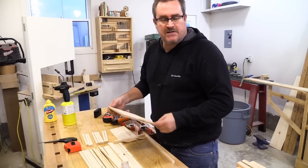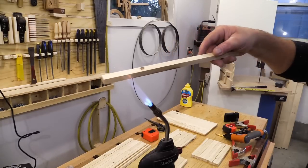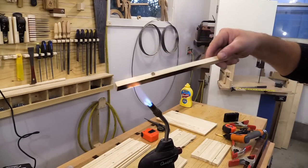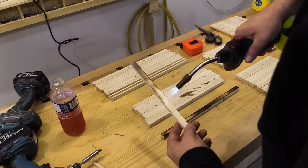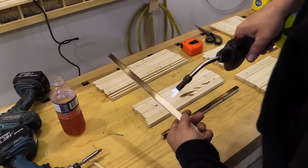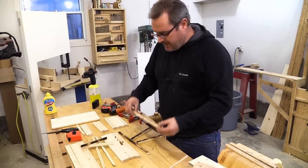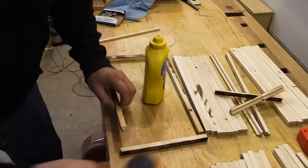Now that I've got the bottom finished, I can start assembly — and that's pretty straightforward. But before I start assembling it, I have to pre-scorch the wood with this torch to give it an appropriate look. I know this is tearing a page right out of the 1970s souvenir-making playbook, but it does give me the look I'm going for. Now that I have the first few pieces scorched, I can start putting it together, beginning with the row on the bottom — just gluing those and tacking them together with 1-inch pin nails.